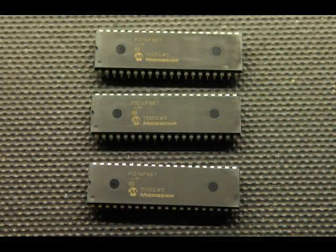For many people the PIC type microcontroller has an obvious way to move forward. These devices make it easy to produce a circuit that is fast and powerful with a minimum of complexity. Take for example the 16F887 by Microchip. In its 40 pin package it contains program memory, RAM, timers, serial comms and other IO devices, making it a potentially very useful device.